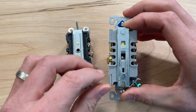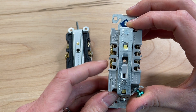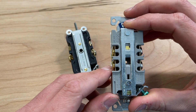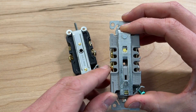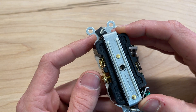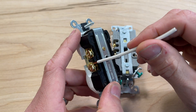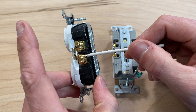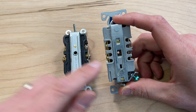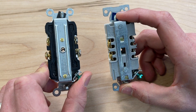For back wiring, the Eaton has an internal plate — you push the wire in and as you tighten the screw it pulls the plate toward the outside contacts, securing your wire. It's very similar to what you'll see on GFCI receptacles. The Leviton has an external plate that gets pinched by the screw tightening down on the wire. Comparing the two, I would say Eaton has a better design here — it's found on higher-end receptacles and is more robust than the thinner external plate on the Leviton.